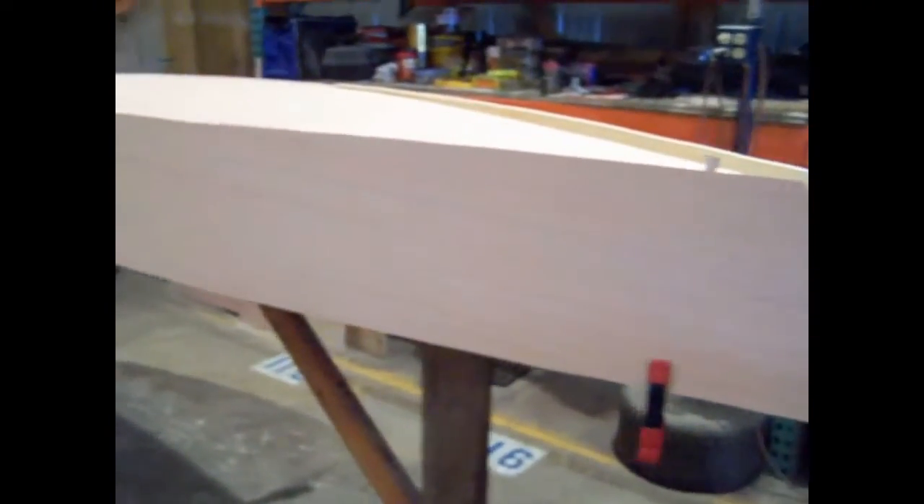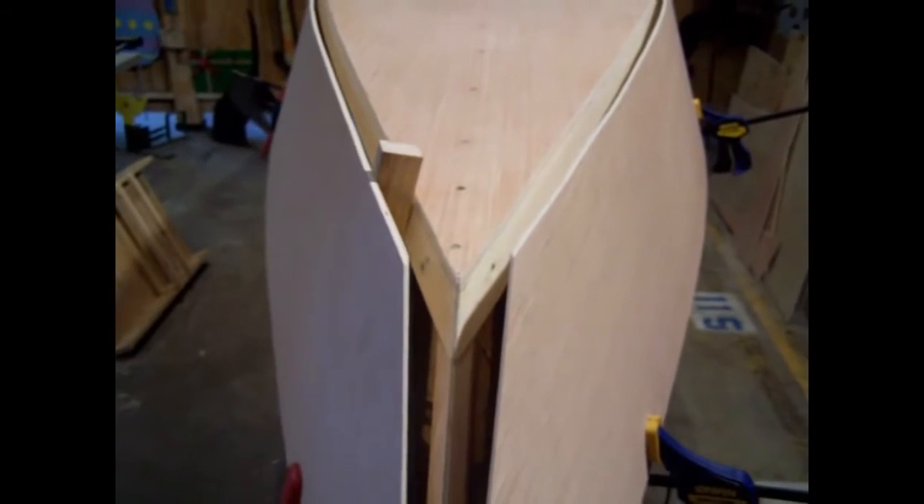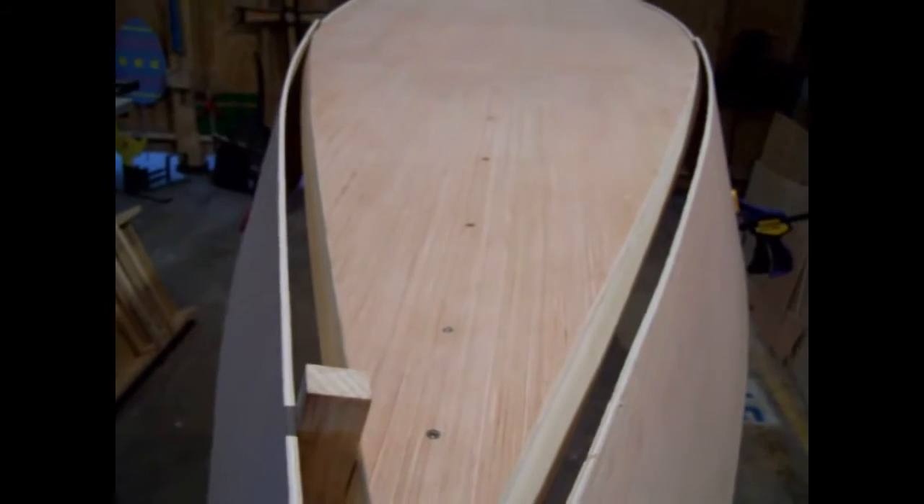Just like the other pieces we'll take the plane off this last little bit. I tried to keep it as close as I could but you don't want to get stupid about it because then you end up short and that's no good either. I got the other two pieces on this end done — they're a little trickier because you've got to make sure you keep this end tight and square. I do both pieces so I can taper the very tip so that when you put them together you get a nice tight joint. I've been using a trim nail gun because the 5/8 nails seem to hold it fine — it's impossible to clamp up here without making special blocks and having long bar clamps. I found if I just keep it tight and use the trim gun while gluing it turns out fine, as you can see on the other side. There's no seam or nothing — it's real tight.